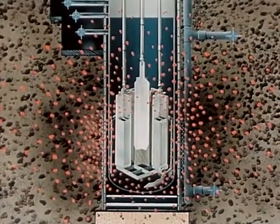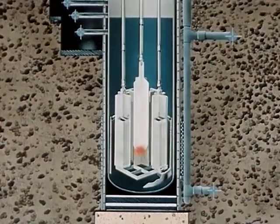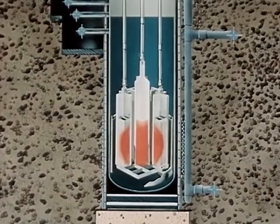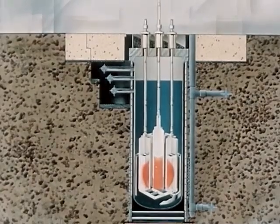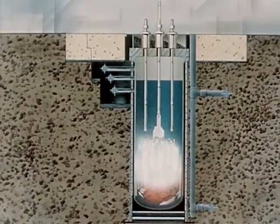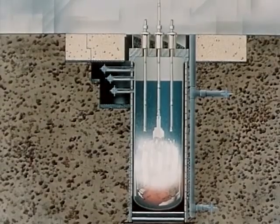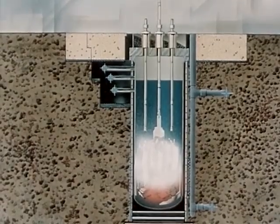A metal-water reaction probably contributed 20 MWS additional energy release. The fissions occurring within the fuel plates increased the temperature of these plates to a point near or above melting depending upon location in the core. In the center regions of maximum neutron flux, the fuel within the plates experienced vaporization temperatures and burst the plate cladding. Thus the spewing of hot vaporized fuel rapidly produced steam in the surrounding water. The steam was generated at a rate far faster than could be dissipated and the resulting outward expansion of this high pressure steam bubble of at least 500 PSI damaged the core.